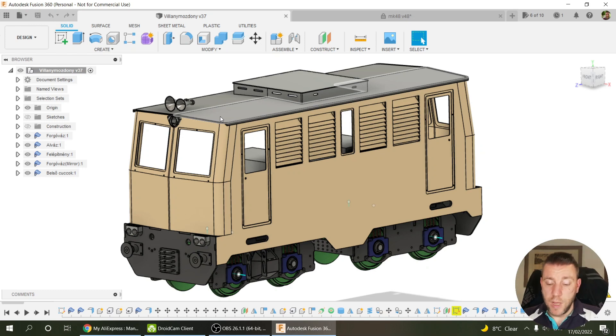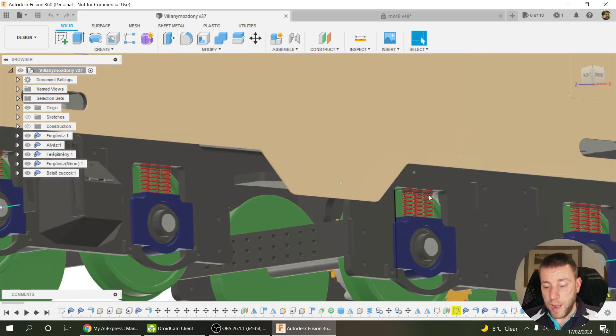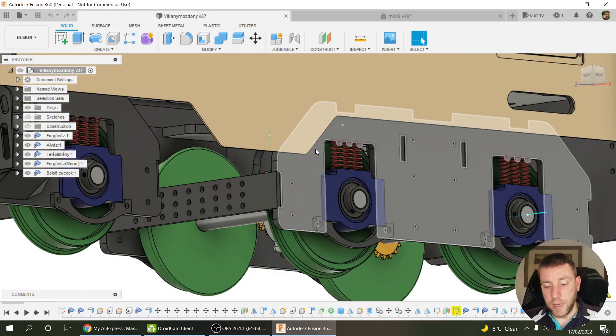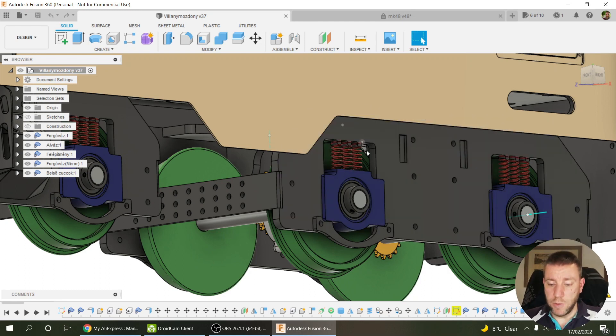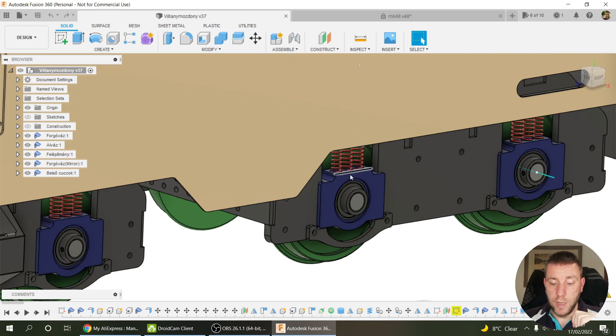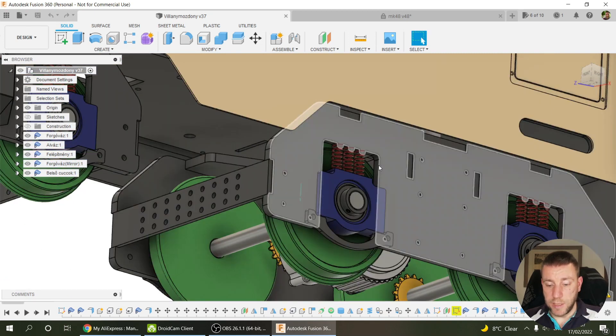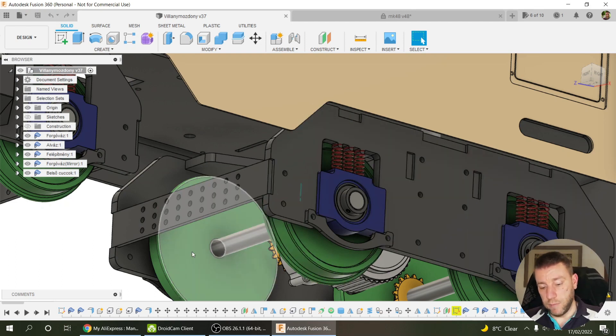I designed something very similar to the carriages I already have, using V-shapes — I think they're called W-guards. I use these blocks, I think the T204 blocks, which usually have an additional piece that in my wagons are basically milled off. I've created some pockets for springs, and this is how the axle is sprung. That means this whole side plate is quite large compared to the wheels and everything.